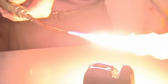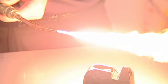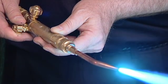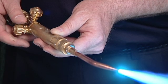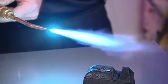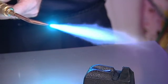We are using an oxygen acetylene torch. However, air acetylene with a proper torch tip, or any fuel gas that can rapidly heat copper, would also be suitable. A reducing flame is recommended. The flame should be soft enough and large enough to envelop both the tube and fitting.